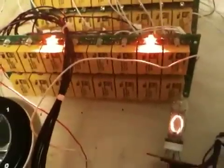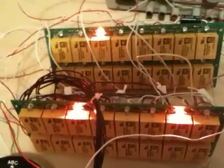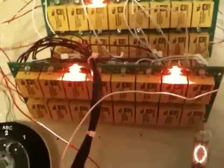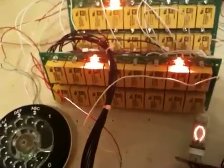Over here I also have a Nixie tube, just a single digit. This is going to be part of the entry register and display unit. The first board is a binary decade counter, which counts dial pulses from this phone dial here. The second board is a 4-bit binary latch and display decoder for the Nixie tube, and it also carries out a bunch of other functions for other parts of the circuit as it comes together.